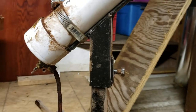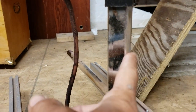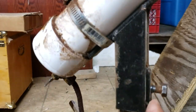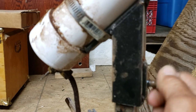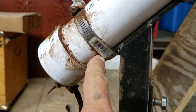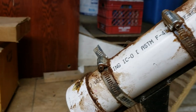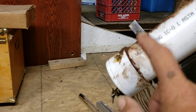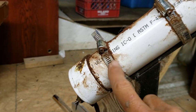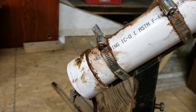Basically all I did was take a piece of square tubing that fit over the upright on the mill, and put a pinch bolt here so that it can be tightened down and won't vibrate off. Then I welded a bar across the top of it, and then this PVC pipe with a couple of caps — this one is glued, this one is not. Then just used some hose clamps to clamp it onto that bar, which holds it in position.